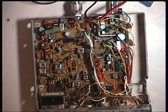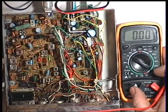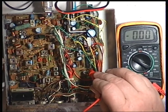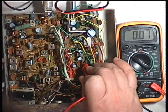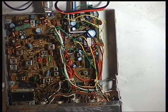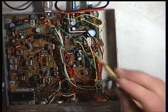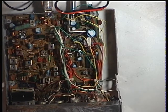With the circuit diagram in front of me - I'm using the Amstrad 901 circuit because I can't find a Fidelity manual at the moment - on receive I should have FM hiss, and I haven't. So I'm going to check the voltage of the LA 1230, which is the IF subsystem. According to the circuit, on pin 11 we should have full rail voltage. We have - 13.6 volts. I can't think of a reason why we shouldn't have FM hiss, so I suspect the LA 1230 is faulty. It's quite possible this radio has been 24-volted, or reverse polarity - I also notice there's no polarity protection diode. If it's been reverse polarity, every IC in it will have been destroyed. So we'll just plump for that and swap it.